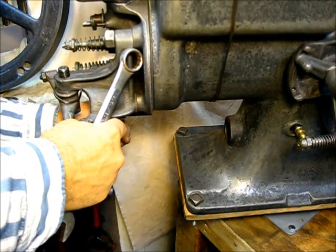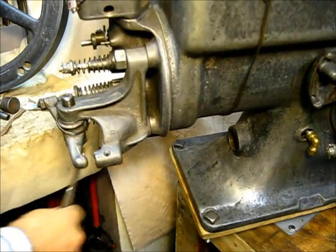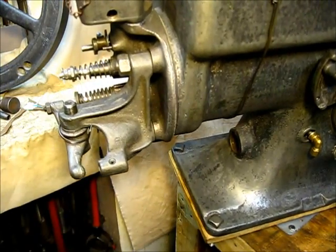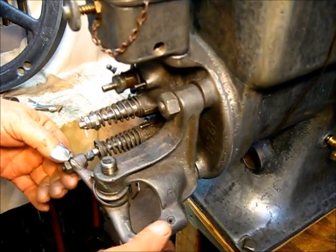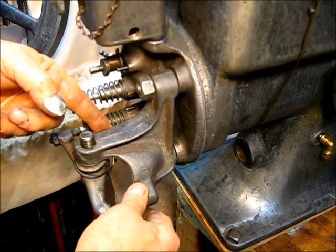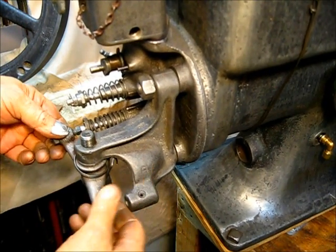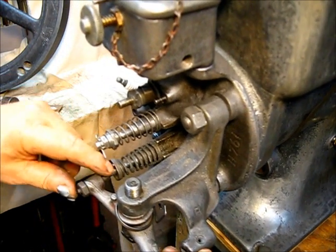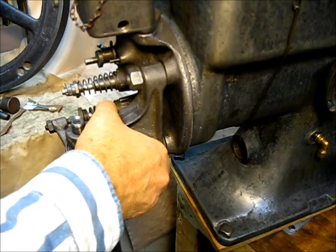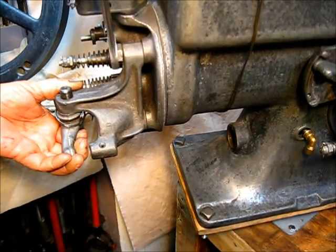Get the one in the bottom down there — put your two wrenches together and undo them, free that up a little bit. That's a good thing about that gasket sealer — you can let go and catch it again without losing your seal. See how much that moves — it's got quite a bit of play on that half-inch bolt. With it loose, I can twist it and you see that rocker arm come up dead center on that valve head. I'll hold that twisted and re-tighten these bolts.